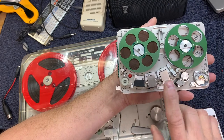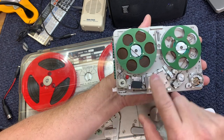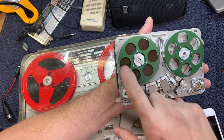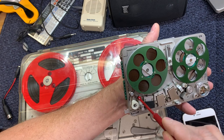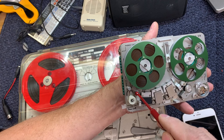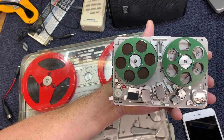It's a very helpful tool because you can be listening to your recording with your headphones with a microphone somewhere in the room, and you can tell whether it's too loud or not loud enough, and then you can adjust the gain and the compression right here on the ALC and get rid of the clipping or whatever happens to be occurring on your recording.